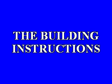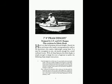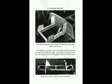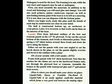The layout. First, draw full-sized outlines of the bow and transom panels on the half-inch fir plywood. To lay out the curved bottom of the transom, tack brads at dimension points. Then spring a quarter-inch thick batten around these brads and draw the curve along the batten. Either cut out the panels with your saw angled to cut the bevels shown in the plan, or cut the panels slightly oversized and bevel to the outlines with a plane. Or, if you're careful, with a belt sander.